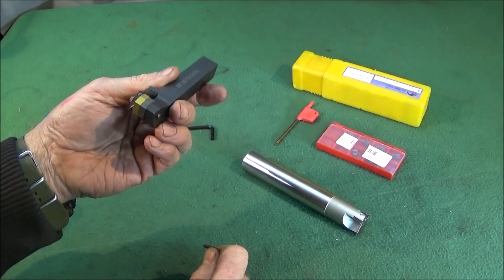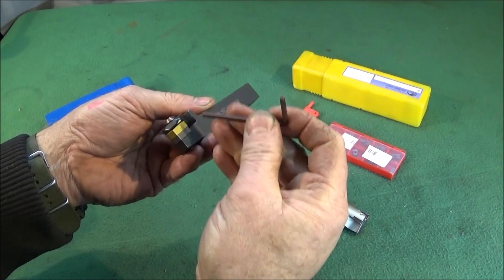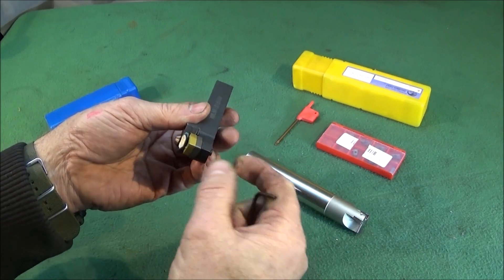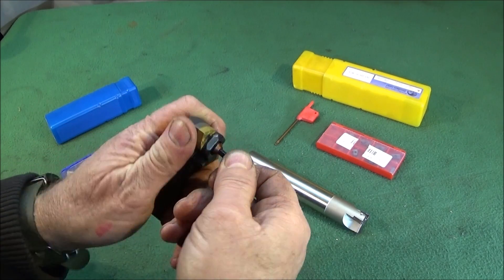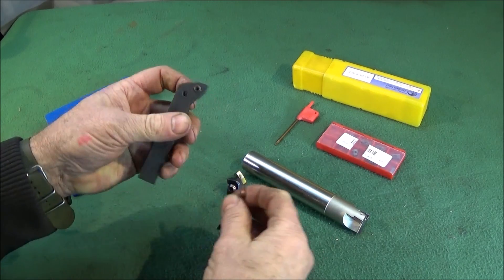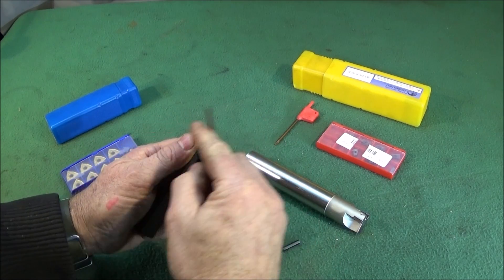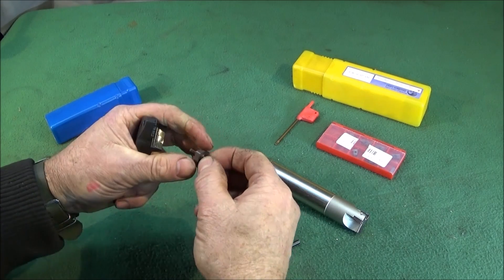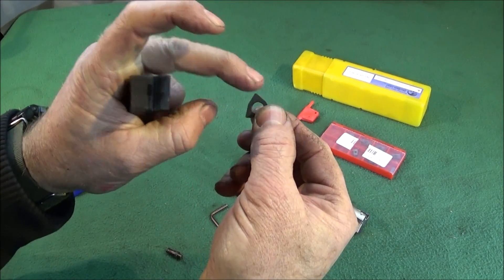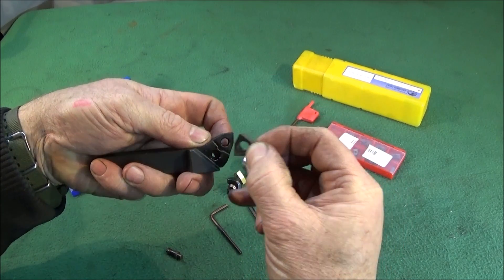The pad is there to give added strength, but I've seen these on CNC machines break — very often it'll take the edge of the actual pad off and you need to change that round or replace the pad altogether. To do that, you take the insert out, take the clamp right off the top, then use the smaller allen key in the underside clockwise to wind the center pin out, and the carbide pad or shim comes out. You've only got three edges on this one because it can only go in one way, so make sure it's nice and clean to put it back.